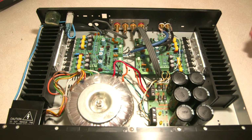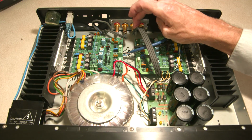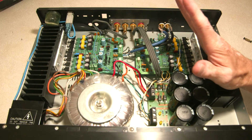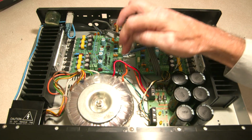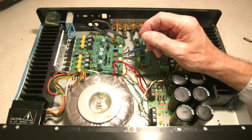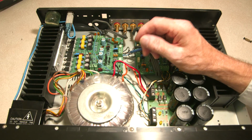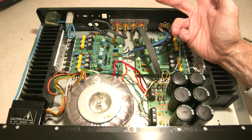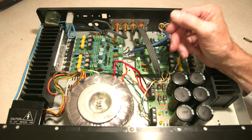So the key was to get the holes drilled properly for proper location, and I didn't take as much time as I should have to identify precisely where those holes should be drilled. I should have then used a punch to start dead center where the hole was, and then pre-drill with a smaller drill, and then move up to a larger drill to size to get the clearance.